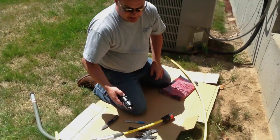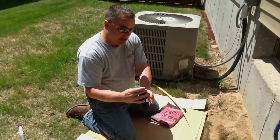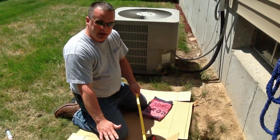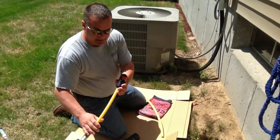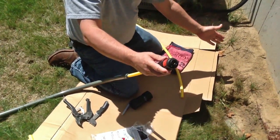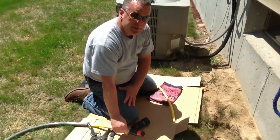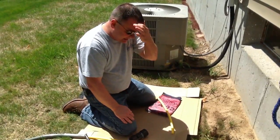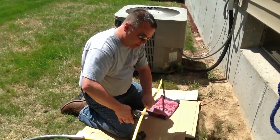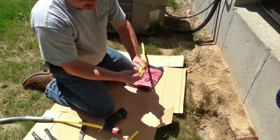A couple of the key points again are going to be the actual chamfering of the tubing. This chamfer tool is double-ended — one side does one-inch copper tube size, the other side does half-inch copper tube size. Once you're where you need to be and the trench is dug, you want to have a clean place to work — a piece of cardboard or whatever. We're going to take a simple poly cutter and just cut the tubing. All we're looking to do is get a clean, straight cut — which we have right there.